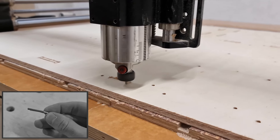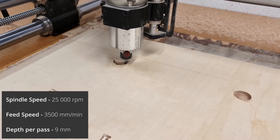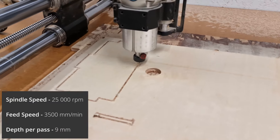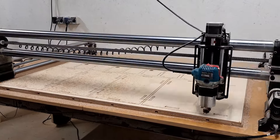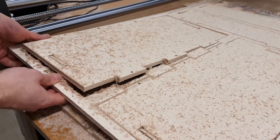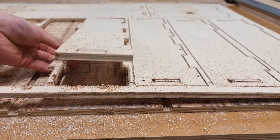For these operations I'm using a 3mm straight flute router bit at 25,000 RPM at 3,500 millimetres per minute feed rate. This allows us to make all the contour cuts in one pass and avoid using support tabs. After all the parts are made we can simply pop them out of the sheet and continue with the next components.